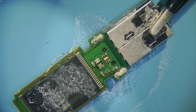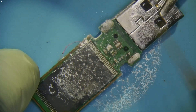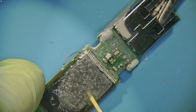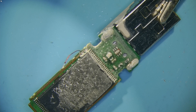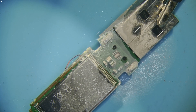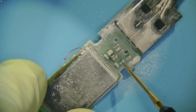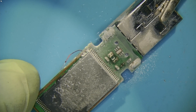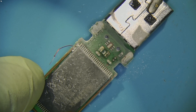We spray the cold spray. The probe is currently injecting one volt into this line. Look what happens — you see it immediately goes discolored. Let's spray more. Yeah, you see right there — this is getting hot. So we know that capacitor is bad. That gives us a clue to remove it if you haven't removed it already.